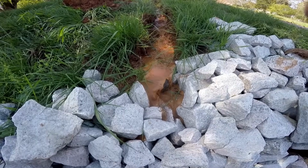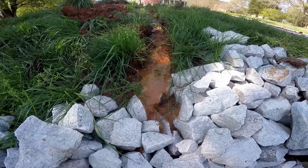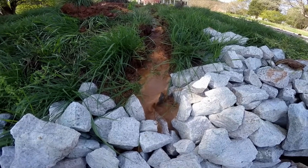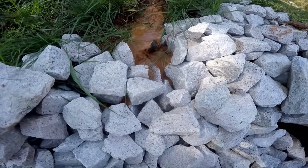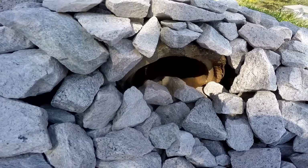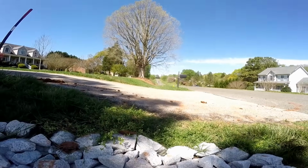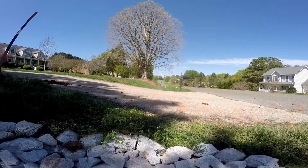So here's what it looks like before you install your pipe. You can see, again, we're cleaning off the footer, running water back there on the foundation of the house. That water's just pouring out here. We've got tremendous fall, discharge to daylight, goes into the riprap, basically disappears. We'll end up down inside this culvert pipe, and that culvert, if you can see the street, just drops off dramatically down to a major storm drain about 3 houses down.